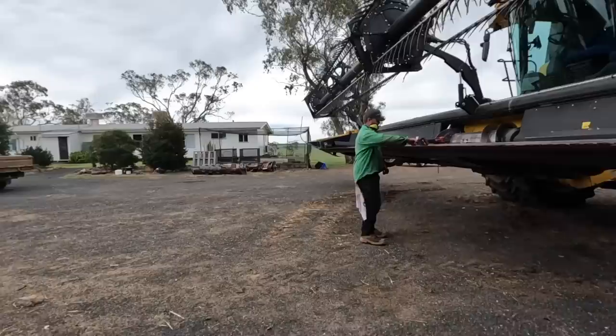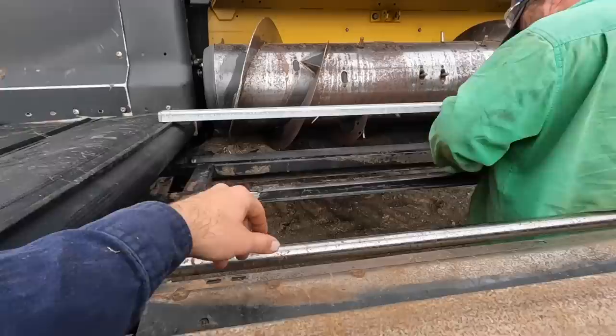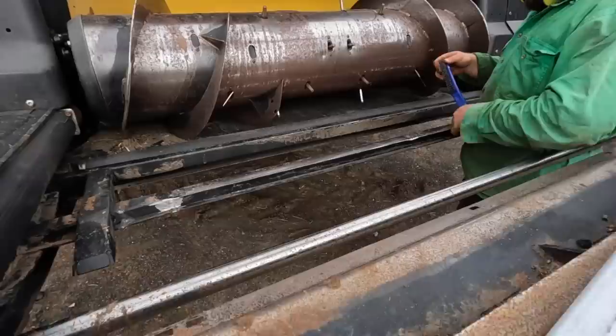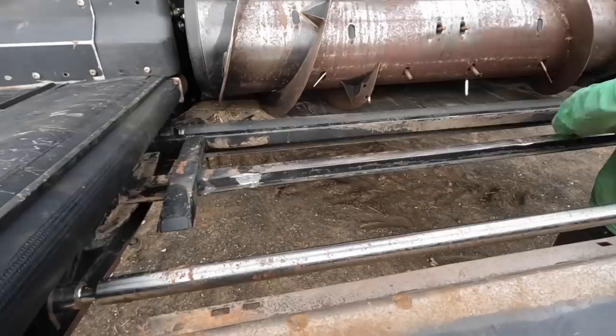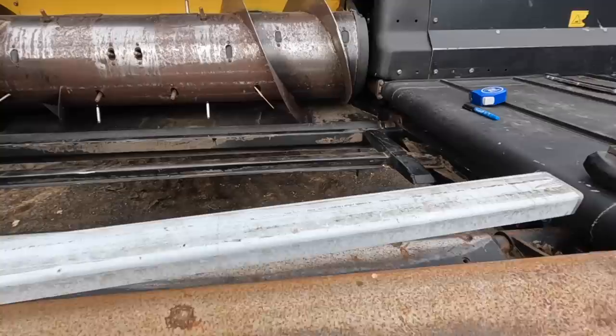If you followed the last video, you'll know this is the header front that Brad was using. Do you think there's a bit of carnage here, Josiah? Just a little. But we do have the stainless steel channel there. Do you want to just lift that over this way, Josiah? Please. There we go. So this is the channel that we got folded up. So it's stainless steel. I think it's 2mm thick. And that is going to go over the top of that because the draper belt's moving over it. When you've got the weight of the crop on there, it's going to be rubbing on that, so we don't want that too thin or we'll rip the draper belt all up. So Josiah's here just trying to get that all fitted. Hopefully. Yeah, that'll fix most of our issues there and beef it up, strengthen it up a bit as well.